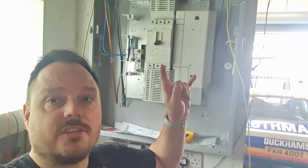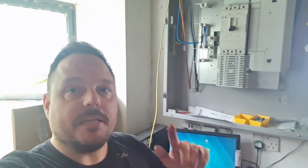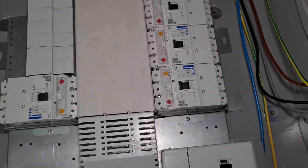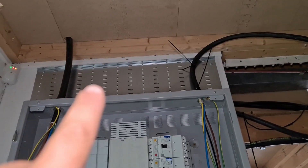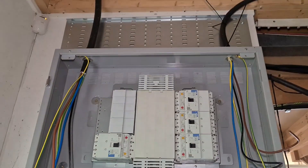We're going to get the power off on this one in a little bit and then I'll maybe do a time lapse of me wiring up the MCCB board. The last time we covered this we were missing the switch connection kit - that's all in now, and once I've got it apart to get the main cable in I'll show you how all that works. You can see the MCCBs are ready and we've got the torque wrench we're going to use to torque these up - I'll show you that in action as well.